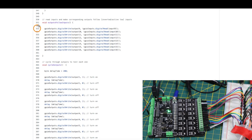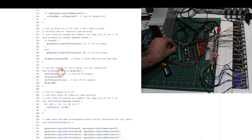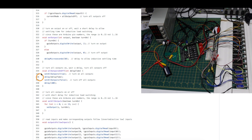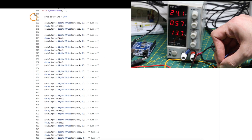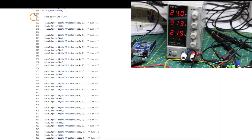To test the high current outputs, I made several test functions. One reads eight of the digital inputs and turns on the corresponding digital output if they go low. There are other functions like turning on all outputs, waiting, then turning them all off, to exercise the board and see what happens when drawing eight or nine amps at once. I also used an LED connected to plus 9 volts and the low power outputs to confirm the NPN transistors can connect the LED to ground. The solenoids draw around half an amp each, so all 16 on at once draws between eight and nine amps.